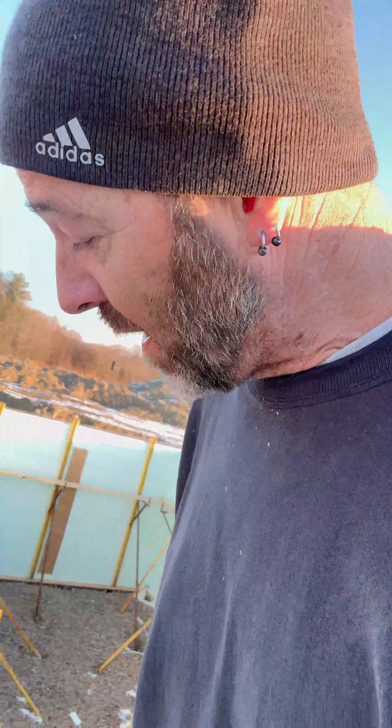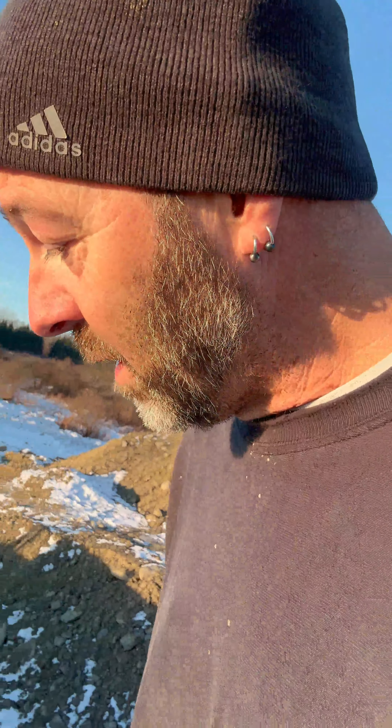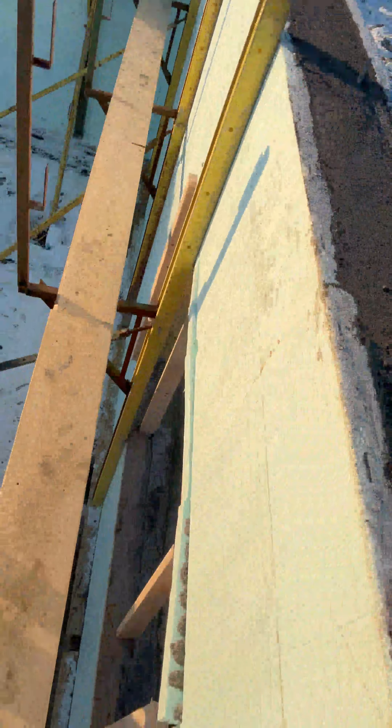We are day one post-pour. It went very uneventful for us. Things you always hope don't happen are blowouts in the walls — if you take the time to brace them up properly and take plenty of precautions, you can have a very successful pour with no blowout. We've done this for so long we don't consider blowouts anything really major anymore. We also have to remove all the bracing from the window openings.